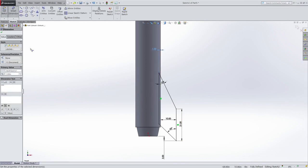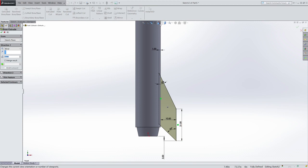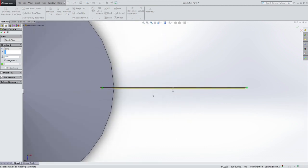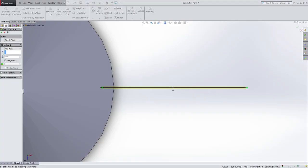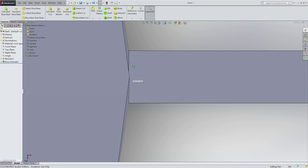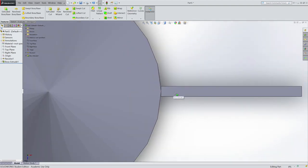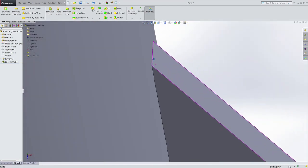Now I have a fully defined sketch; I can go to Features and create an extruded base. I need this extrusion to happen symmetrically, so I'm going to use the midplane. And I need it to be a total thickness of 0.75 inches. You see this checkbox? It says merge result — that's what I was referring to earlier; SolidWorks is going to join the bodies. And there we go, we have a fin. So even though SolidWorks is showing this as a polygon instead of a round surface, it actually is behaving correctly, and there isn't a single gap at the edge of my fin.